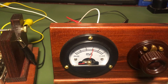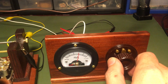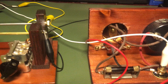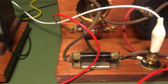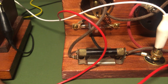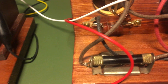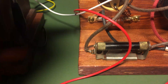This is the rectifier section and it's got an Atwater Kent selector switch — this is off of a Model 20. I think they put them on a few different radios. In the back here I've got a couple of different crystals to choose from. This one is actually a grid capacitor-resistor circuit where they opened up the resistor and put a germanium diode in there. Behind here in this little glass case there's also another crystal. The difference between the two is that the one with the capacitor gives a bassier sound.